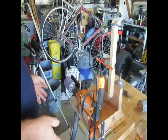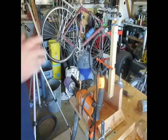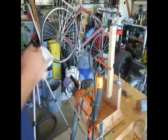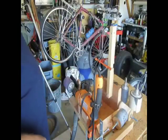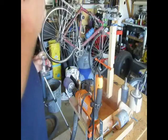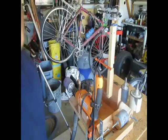It's real important that you wear breathing protection and eye protection when you're grinding glass. I shouldn't have to tell you that, but just in case — glass inhaling is a bad thing. Let me get my breathing protection on. I'm just using a basic dust mask. I've got the vacuum and my drill hooked up to the same switch, so I can't have one without the other. Before I forget, eye protection is a must. My glasses are polycarbonate, meant for doing this sort of thing. Always protect your eyes, and on this one, make sure you protect your lungs.